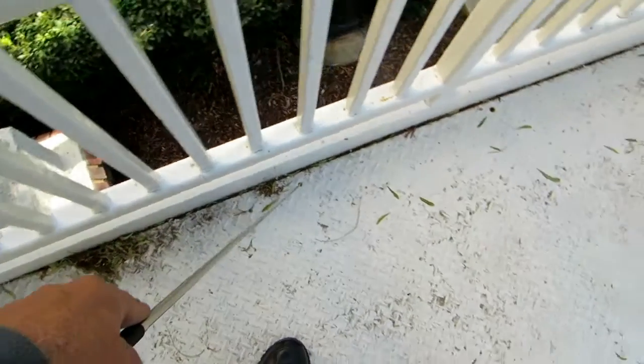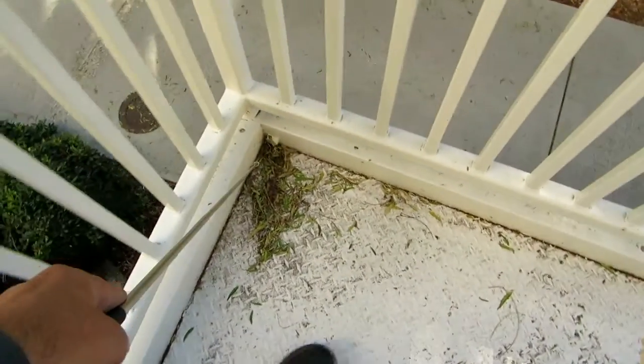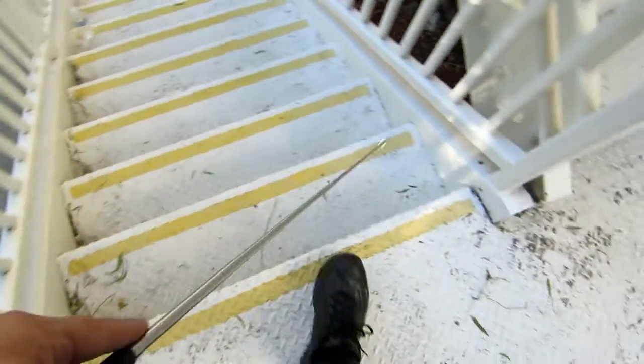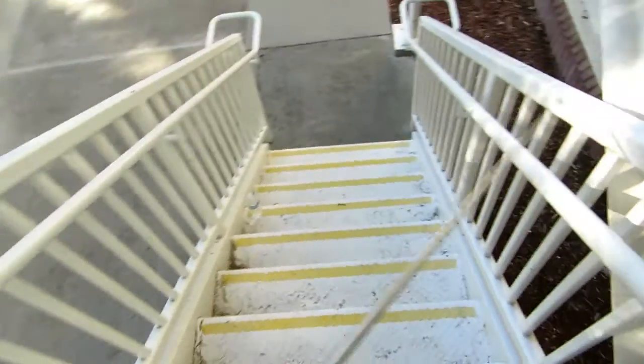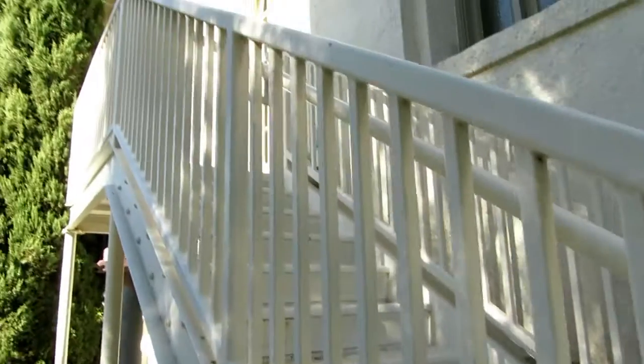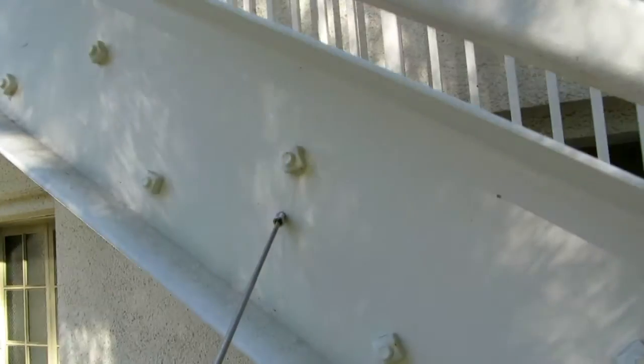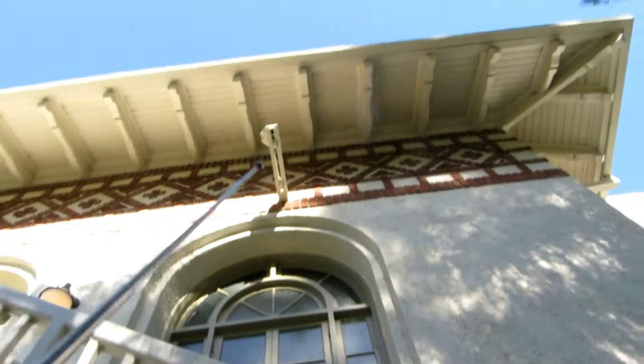Look at the gap here. That gap is almost 3/8 wide already. And again, debris, matter, water, you add those 3 things, feeds water down. Rail's in pretty good condition, fairly new. So shop welded, bolt, field bolt installed or welded. Original hardware, notice, square head bolts on this firescape. This used to be a cantilevered system, and they replaced it with this system.